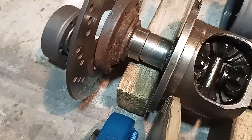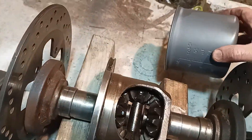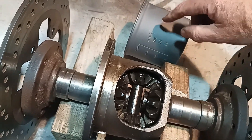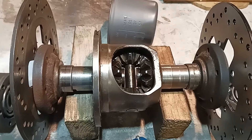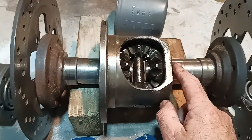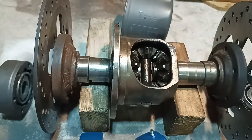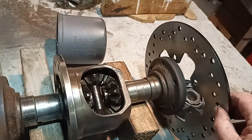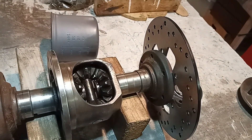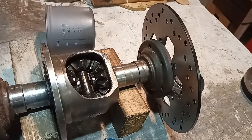All of the spider gears are encased in a pot which will very nicely slide over the whole assembly and retain the grease. There's a lot of machining to do essentially to bring these surfaces down to the right diameter and to be concentric, so that I don't get vibration through the diff, which spins at quite a speed. Similarly, so that I don't get wobble, pad knockback, and vibration through the rotor and disc brake system. So let's get into it.